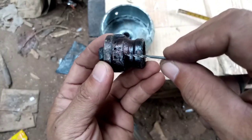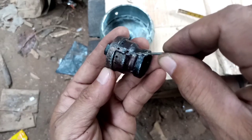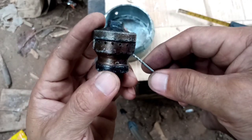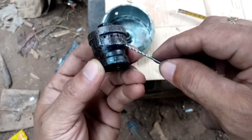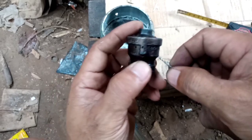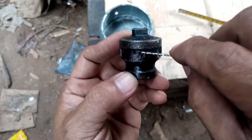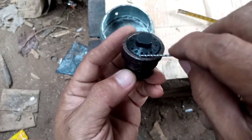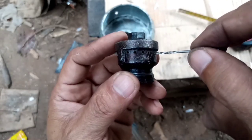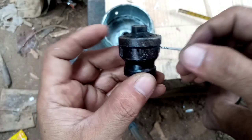For the one-half coupling end plug, we have four holes directed downward using two-millimeter drill bits. This design has three layers: the first layer, the second layer, and the top holes. For the second layer, I use 1.5-millimeter drill bits with 16 holes directed straight.